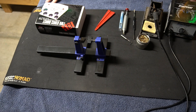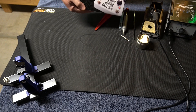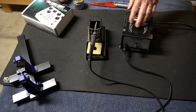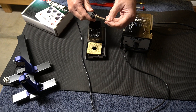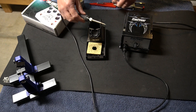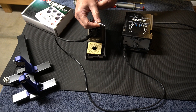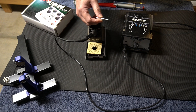What I've got here is basically the minimum stuff that you're going to need to get the pedal done. First off you need a kit of some sort. You need a good soldering iron — something that you can adjust the temperature on is preferable, and something that you can change the tip out on. This one currently has a chisel tip that I use when doing pickups and guitar building, but we're going to be putting a pencil tip on it, which works much better with printed circuit boards and the fine soldering we're going to be doing on this pedal kit.